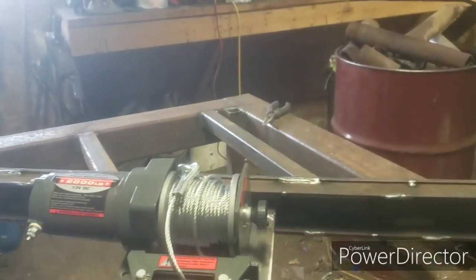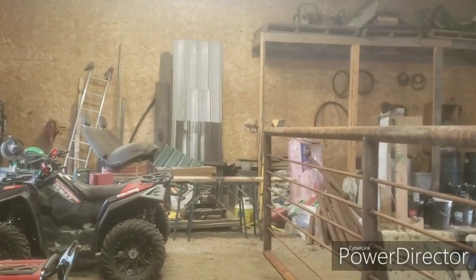So I made this channel iron. As you can see, we got the holes drilled in there. That's where the rafters are, up in the top. So there, we got two there. We're going to put this on 3 rafters up in the attic. We got that 2x10 right there on the sawhorses. She's ready to go up above, on top of the rafters, inside the attic.